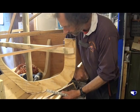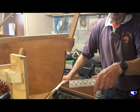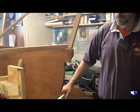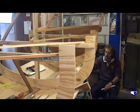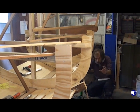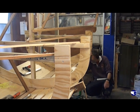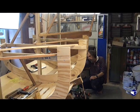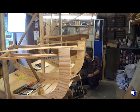Just want to go down that, tap more. Past our eye along the plank, make sure it's touching all the moulds. It's lying fairly flat in our bevel. Just to check really - is our half-lap at the stern? That was planed into the plank below. We just want to make sure that our plank is going to sit in there quite nicely. Maybe a millimetre or two to shave off here or there when we actually come to fit it. So that's looking pretty good.